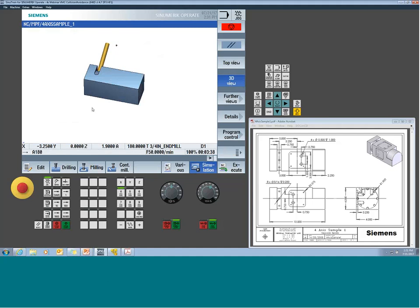So here we're rolling around, machining our groove. Now, where it gets a little tricky in a scenario like this is, what if I want to control the direction? So now I have to play around with things a little bit. I could tell her to go negative, but it doesn't necessarily mean that it's always going to go in a negative direction. So sometimes you might want to break them up. I might even break them up into 3 moves, and then I can control plus or minus if I needed to truly control the direction of that milling of the slot. In this case, it wouldn't really make any difference which way I swing it. But you can play around with that.